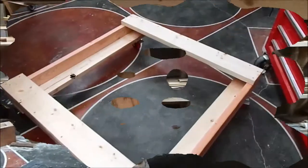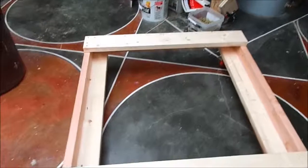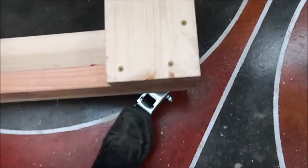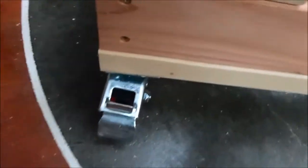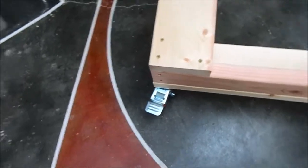That's it for installing the wheel. Here's our dolly completed — as you can see, it rolls very nicely. It's 44 inches by 44 inches. Here's the brake: you step on that to lock the wheel. With just two wheels locked, it won't go anywhere unless you really mash it. To shut it off, you have to push that tab back up. That's why you've got to put the wheel off to the edge — so you can shut the brake off.